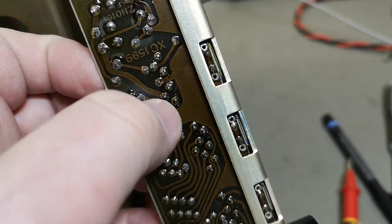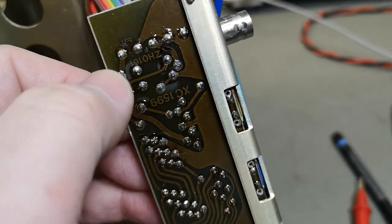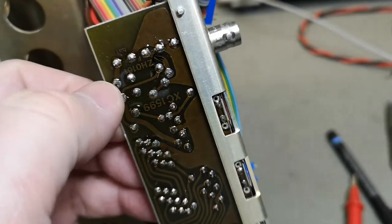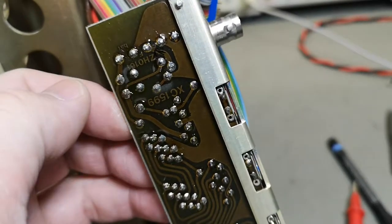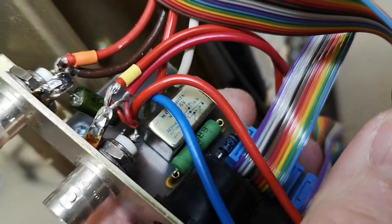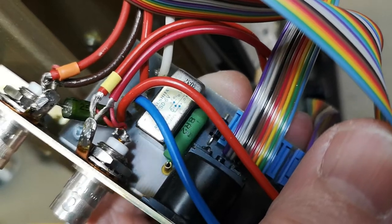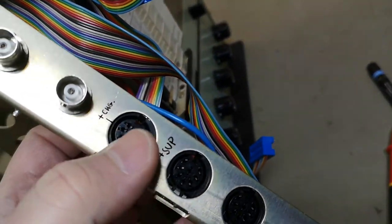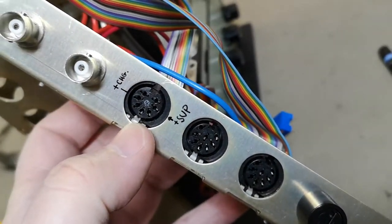This wire or pin is the positive supply. That goes to the other side of the relay — the normally open contact — and then it goes to the coil. So when you activate the coil, the relay flips, and now you've got external power input to the whole unit — it is that simple. How many volts is this unit running on? Well, how about we just check the relay voltage — isn't it six volts? So now we know how to power this thing: six volts DC. By the way, I double checked the other pins in the connector — there are no connections to anything at all.